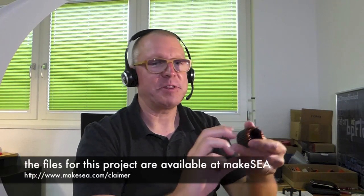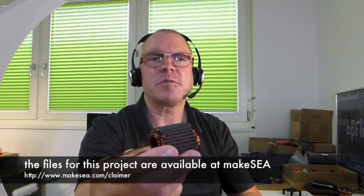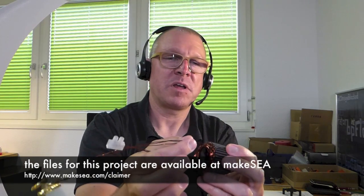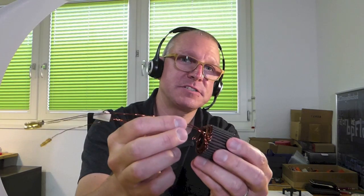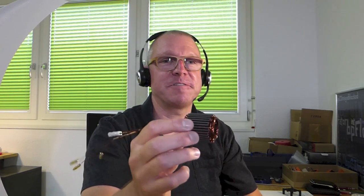So I needed a core with more copper wire turns, and maybe a little bit larger. I built the second version, which is this one here. It has more slots and a little bit thinner wire, which is potentially a problem because of increased resistance. But the more turns were really a good thing, and it ended up with really good efficiency.